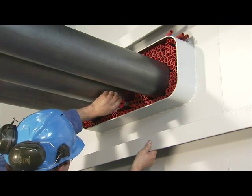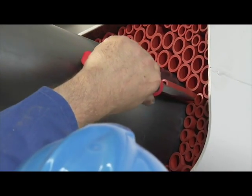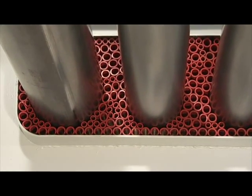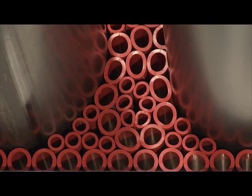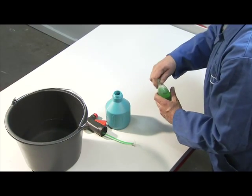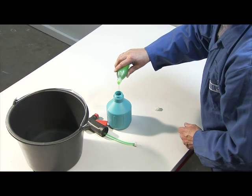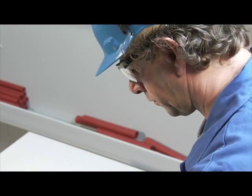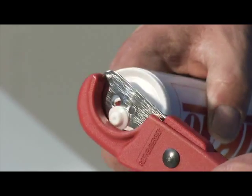It is advisable to perform a final check on the packing of the filler sleeves before finishing the penetration by applying the sealant layer. Prepare some soapy water to finish the layer of sealant after it is applied. Make sure some sealant cartridges are readily available so the sealant can be applied as quickly as possible.